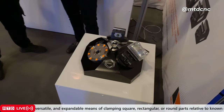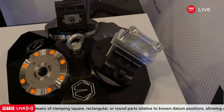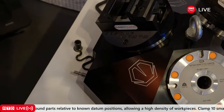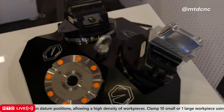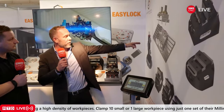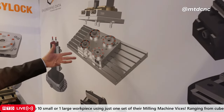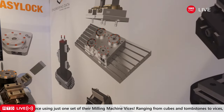That's quite a big saving — how much does it cost to have a machine bed retrofitted with air or hydraulics? This means you basically haven't got to buy a separate hydraulic pump or anything like that. Once you have that, it can work off anything. We've got a special offer on this for the show — that's £3,200 for a four-pot zero-point system, running off standard six-bar air.